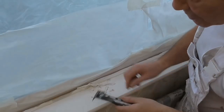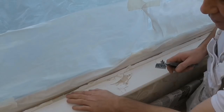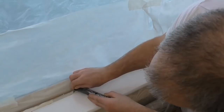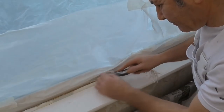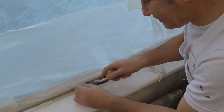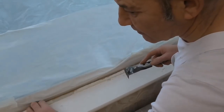Just means now when I start to bring the shave hook over this, try and get this silicone off, where it fractures, it's not going to come beyond. Started to do it here before, so that's why I decided just to cut through. Just on a slight angle. More bothered about removing the sealant than anything else.